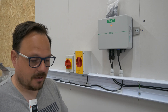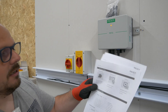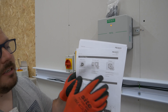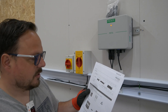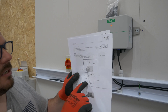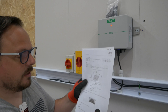Very detailed instruction manual comes with it. There's not really too much to highlight other than the automatic shutdown I mentioned, and how you can have an AC power cut that will also activate it — so if the power's tripped it will shut it down as well, and you can do it manually as I just demonstrated. It tells you how to mount it: basically just a couple of tabs that pull out the side and then you screw it to something reasonably solid. You can wire in an external power light indicator, so if you want to put a remote indicator — because this is going to live in the loft — you could wire in an indicator near the PV inverter.